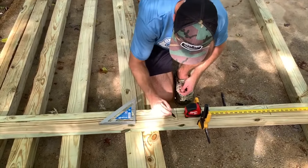It's a little bit tricky to do this. I should have moved the ladder so that I was actually on the fascia board. But basically, do what you can to install the fascia board to the roof rafters. Okay, so we got the front plate on there. As you can see, as I scale this sticky ladder, we have this piece holding it in place. So that's not going anywhere. That's a nice little tip if you're doing this on your own. You can fasten it and let it rest.